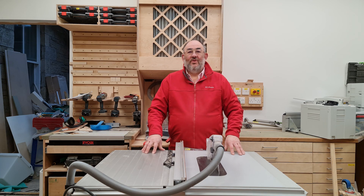My cart was made on the basis that the saw footprint was 663 by 800 millimetres, and that was too tight on the larger measurement, so I've added five millimetres to the dimensions so that you don't need to router a little bit of the outer layer like I had to. The basis of the cart is essentially an inner box that supports the feet of the frame and the side extension table, and a wrap-round of a second vertical layer to enclose those saw feet.